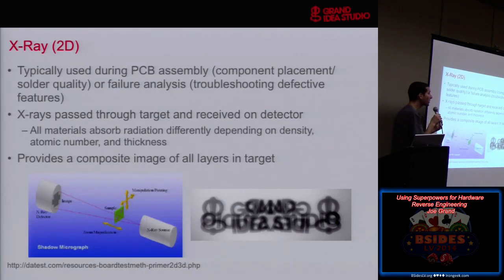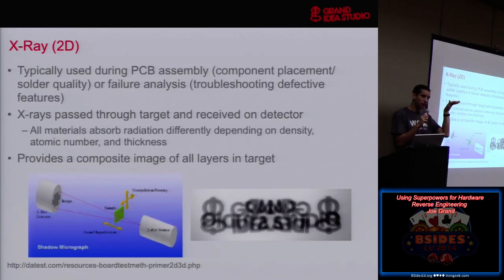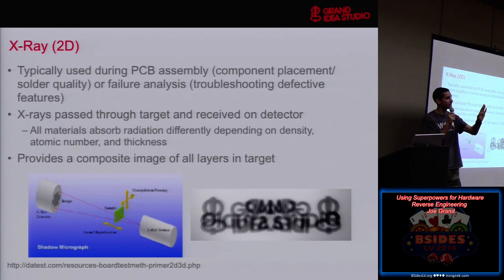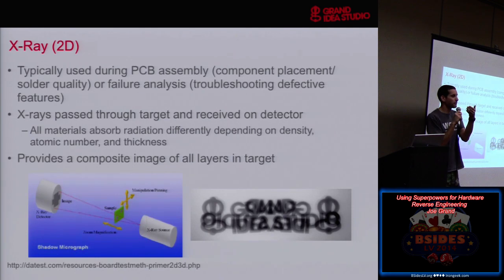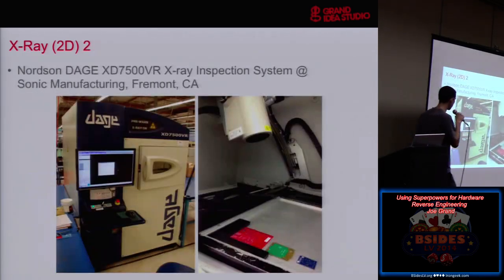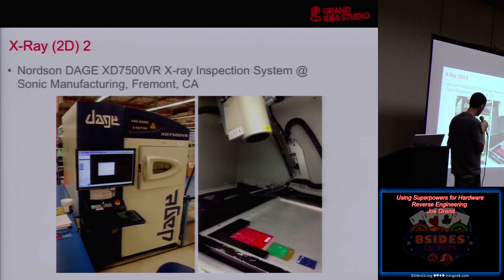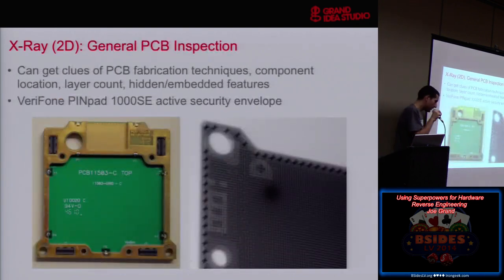It's used a lot, and most contract manufacturers that assemble circuit boards will have an X-ray machine at their facility. That's why I ended up using the X-ray for this experiment — they need it to make sure their assembly processes are right. This is equivalent to the through scan of acoustic microscopy: you send X-rays through and capture the result on the other side, so you get a composite of the entire image. Here's my logo on the test board I had on the top side and the bottom side — the image shows both.